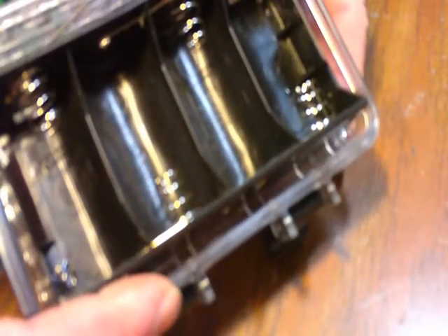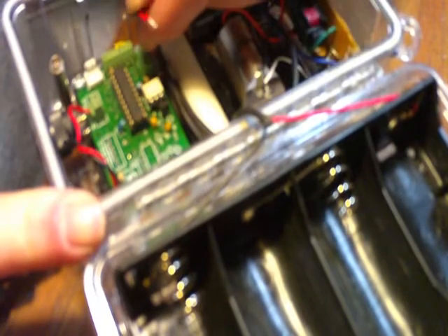Now all I need is a power supply. I put a 4D holder in the lid. This is an S3-T2500 case because I wanted to use more battery power. My cameras can take 500-600 pictures so I want something to match it as far as a slave goes. I got my wires and all I need to do is wire it up — it will be on my first terminal and my fourth terminal. The first terminal will be positive and the fourth terminal will be negative. I'll wire my battery holder in just to power my board — I want 6 volts.